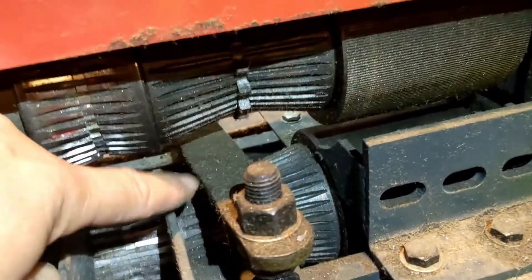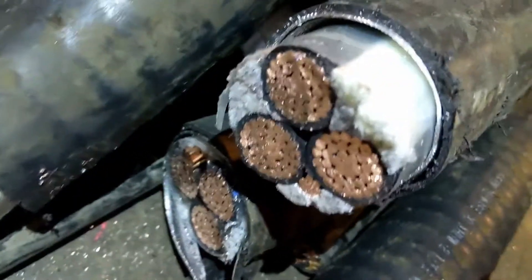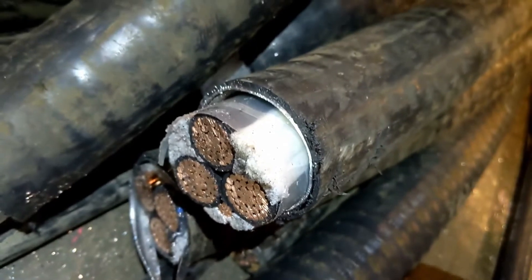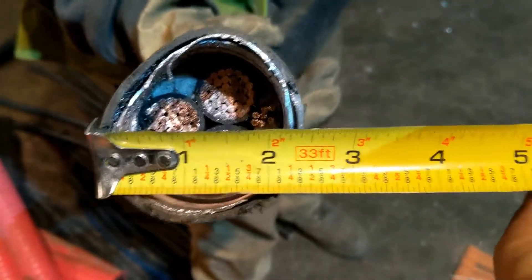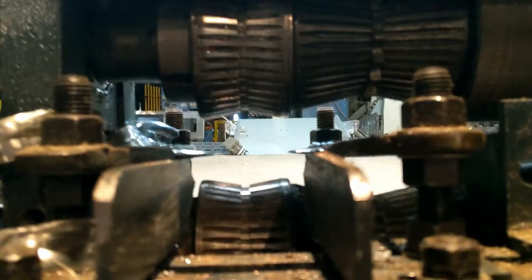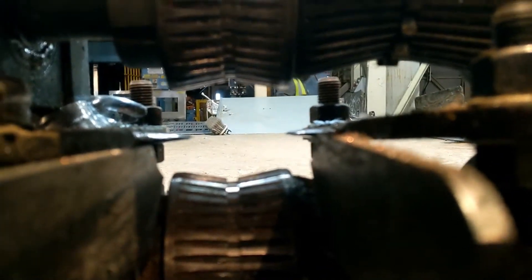So I'm fixing to come over here on this one — I've done two-inch on this one and I'm gonna start spreading it out further. It doesn't look like I'm gonna get my four-inch through there. Have you ever tried to peel four-inch cable with just one cut? So we're gonna jump up. What we have is triple 500 MCM that we gotta cut out. This stuff is two, two and a quarter, two and a half — triple 500 MCMs. This is the reason I bought this machine — to split this bigger stuff. I've got it kind of cutting but it needs more tweaking; it's not doing exactly what I want yet.